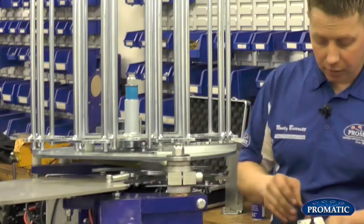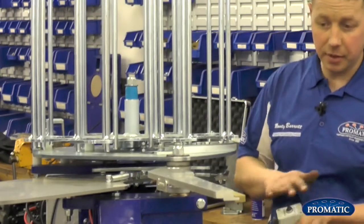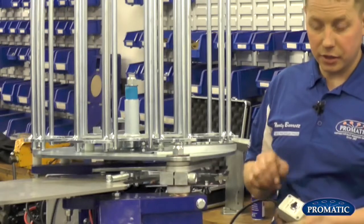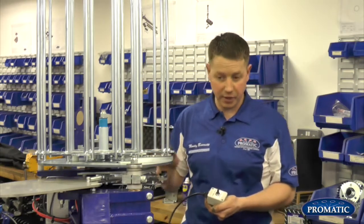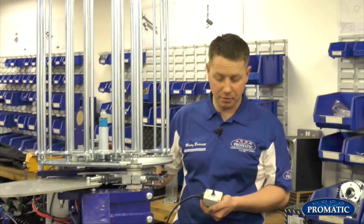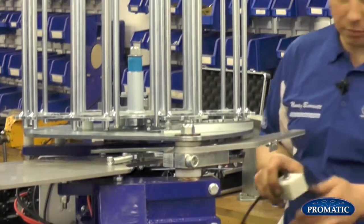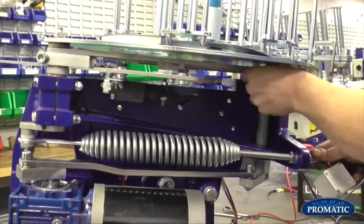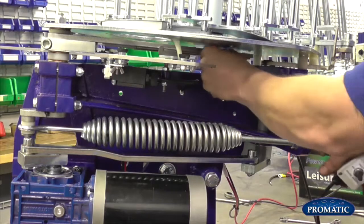So we'll go through that again. We'll disarm it, bring it round, so the arm is sticking straight out in the front of the machine. We will arm load it, so take it straight down to arm load. Now you see the machine is cocked, we'll take it up to off. A lot of people think when you turn the machine off, for instance if you're filling the machine, the machine is safe. But off is actually not safe. It may be there's no power coming into the machine, but it could still fire. So we'll disarm it. You'll see the arm sticking out. Nudge it round, 11 o'clock. Push under, and again you'll hear that dung. Now the machine is perfectly safe. We can push that arm, not a problem at all.